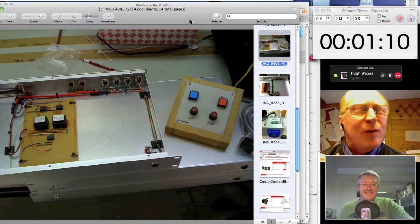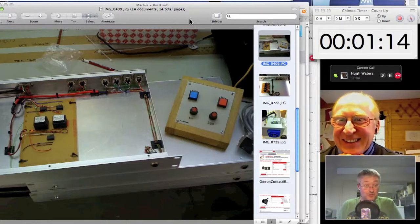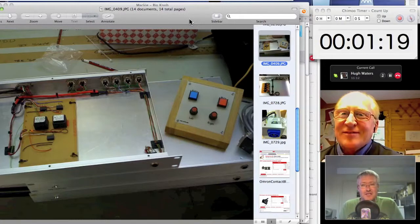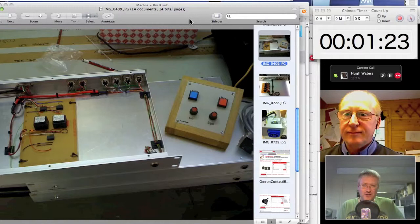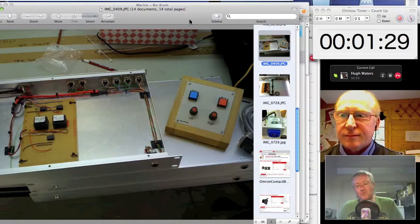Is that still how we do it? Well, yeah, a bit. Obviously, lots of things you need to switch with a relay. The thing that bites me in the backside all the time is GPIs and tallies. You often hear the expression wet and dry GPIs, or voltage tallies or relay closure tallies. Often one bit of kit uses the opposite standard to the other bit of kit, so I often have to brew boxes to make one bit of kit talk to another.